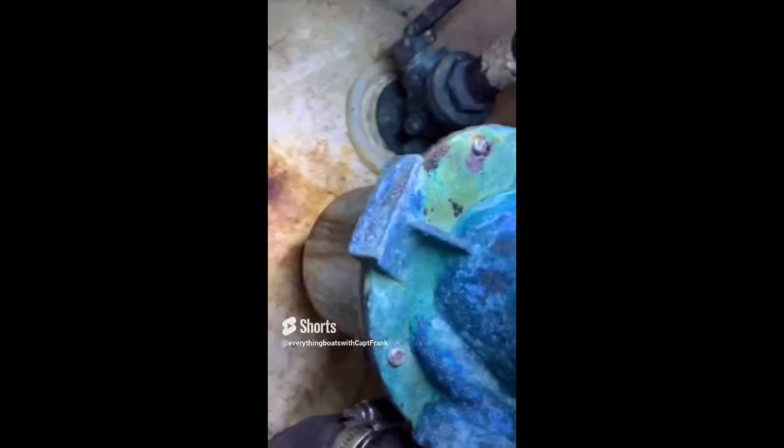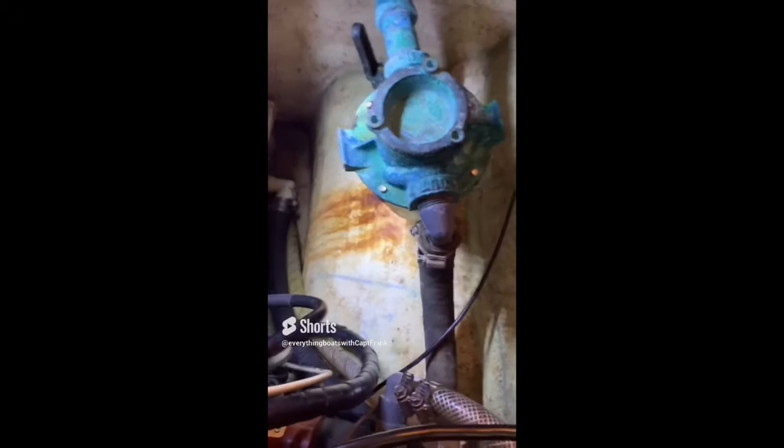A quick shine of the light shows that the hose is also badly deteriorated, cracked, and dry rotted, and is in need of immediate replacement. As we look over on the other side, we see running rust stains and leaks — that's your boat's way of telling you something's going on. In this case, it's corrosion of the globe mounting screws for the strainer itself.